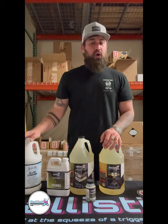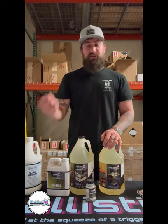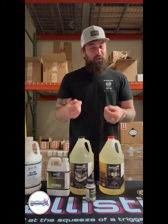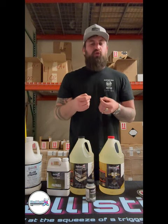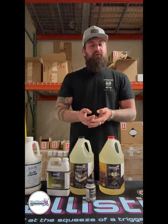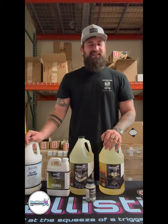For re-coats, there's a common misconception that Ballistix cannot be re-coated. It absolutely can, but it's going to do its job — it's going to push away other things, including itself, if it's nice and glossy. That's the idea behind the product. In order to remediate or remove the product, you either have to mechanically remove it by sanding or grinding, or you can use our silane stripper. That's the convenience line.